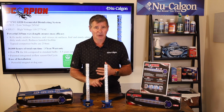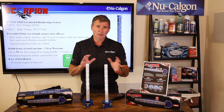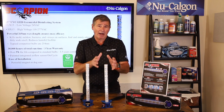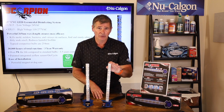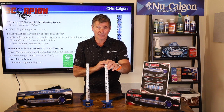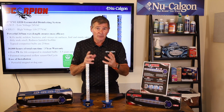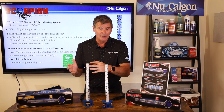Those mercury glass bulbs out there last a year and a half to two years — this is great news for the homeowner when you tell them you don't have to come back and replace this for three and a half years. That's the shortest life you'll get out of this, and when you combine that with the three-year warranty, all but six months of the device's life is completely under warranty.